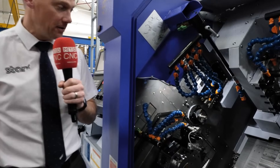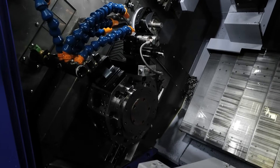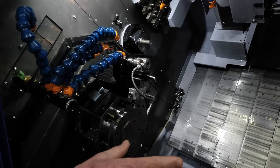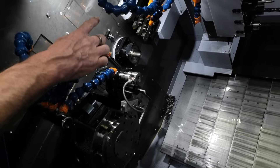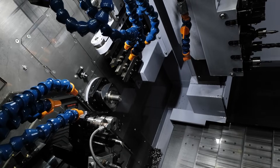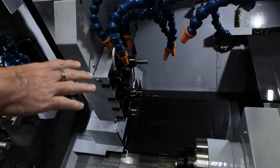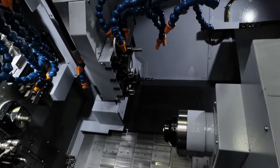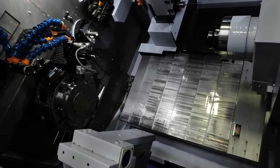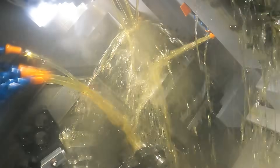The configuration is different on this machine. As you can see down the bottom there, you've got the turret with three axes — the X and Y, and it's also moving its head. At the top there, you've got a platen with a B-axis for doing angular work as well as the turning tools. On the back end you've got the sub-spindle with its own set of tools, so you can do all your overlap machining. In fact, this machine can have three tools in cut simultaneously, which is perfect for reducing cycle times.